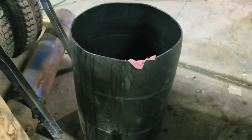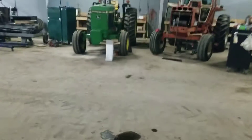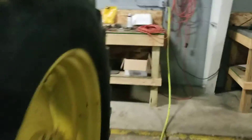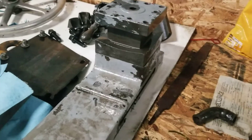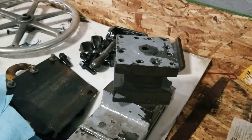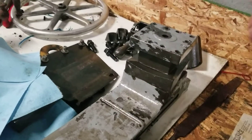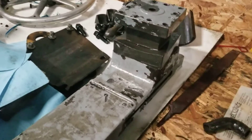So I took this old jug, filled it up, dumped it in this barrel, filled it up nine more times, so we have 10 gallons of water mixed with this. Some of that stuff has been in this barrel since last Wednesday — close to a solid week. But that turret assembly I just showed you spins free. I did zero scrubbing — I took it apart, put it in with rust, gunk, and grease all in there, let it sit for almost a week, and well, like you can see — that's like butter.